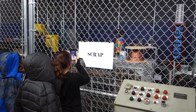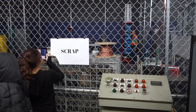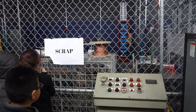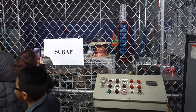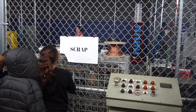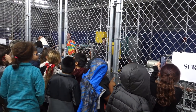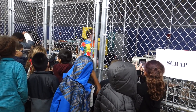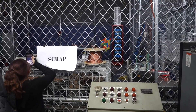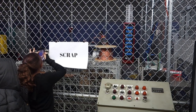So what we're going to do — you see these big balloons right here? Each one of these holds 450 volts. We're going to charge them all up in series, so 450 times 4. What's 450 times 4? The answer is 1,800. We're going to charge all of those up and then discharge that from this giant switch right here, through this piece of aluminum. This is where you want to watch — this is where everything is going to happen.